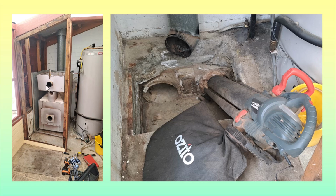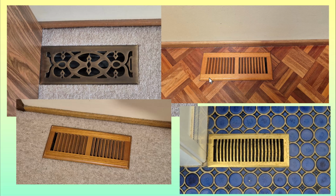When we take the diesel system off, you can see two ducts going through in the floor system. They're 220 millimeters diameter. This one leads to 5 floor vents in the house, and this one leads to 7, and that's been discovered by blowing air and seeing where it comes out. So we have ducts like that, 12 in total in the house, and they'll be used in the new system, plus one extra duct. You'll see how we did that.